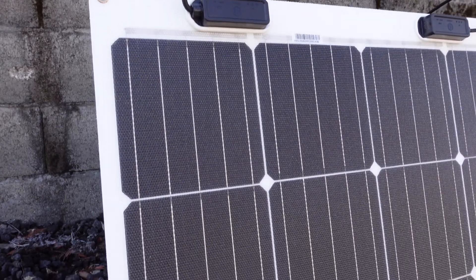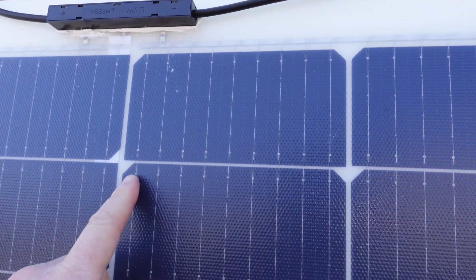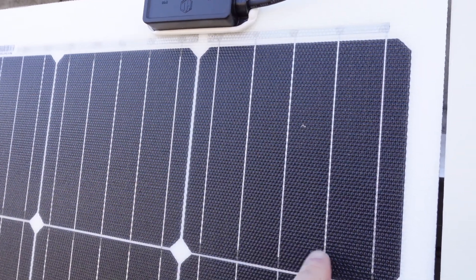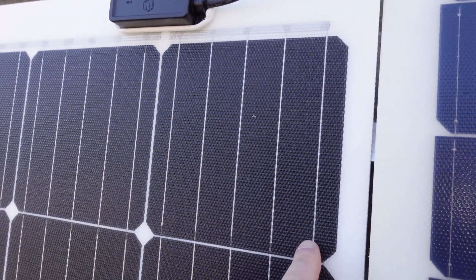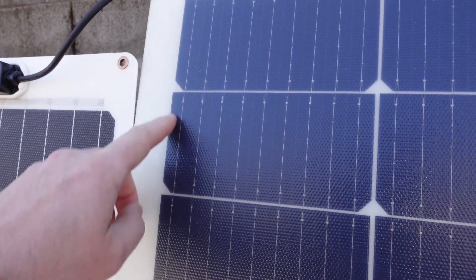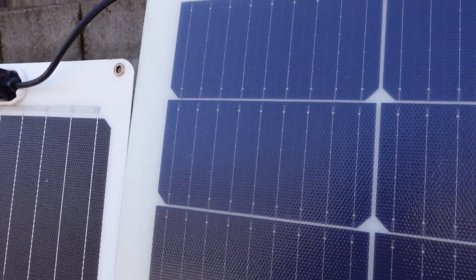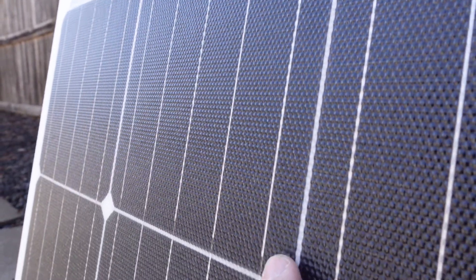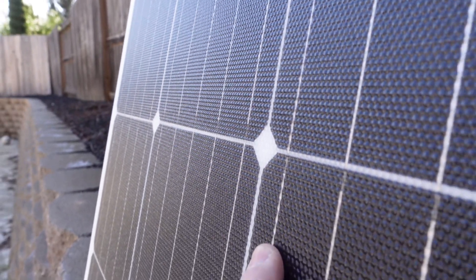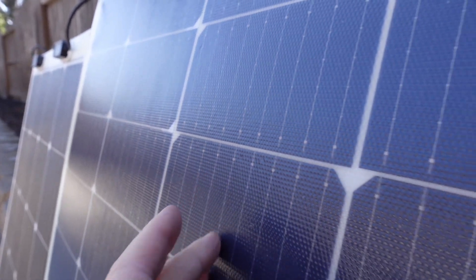This is an upgraded solar panel from the older 175-watt flexible solar panel. The new one now utilizes nine bus bars inside the solar cells, versus the older panel which was only five bus bars and one large cell. These new half-cut cells will reduce intensity between each cell and will also help increase the efficiency and output of the entire module. The older solar panel had transparent dots on it to help refract the light and increase solar conversion. The new solar panel has the same transparent dots, but they're definitely not as pronounced as the older one.